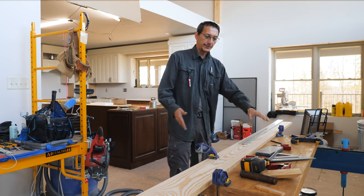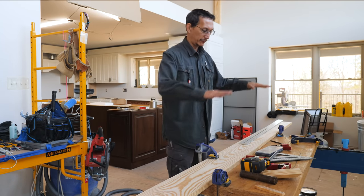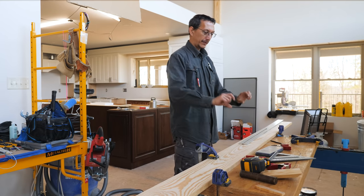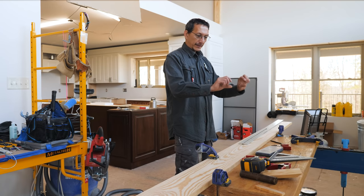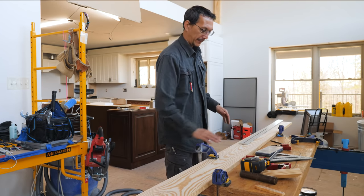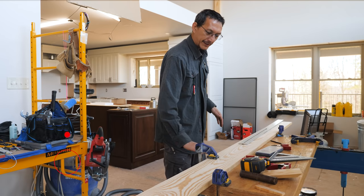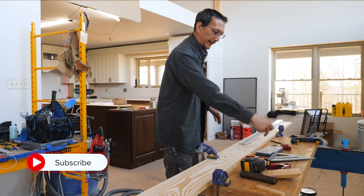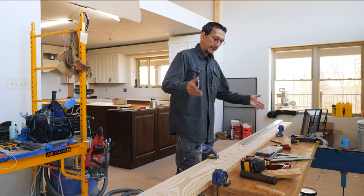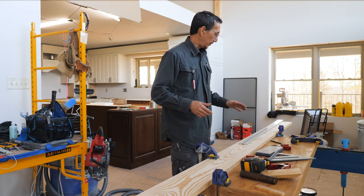This is the shoe rail board, and this is what goes on the ground, on the floor, and then you drill your holes for the pickets. You can do a shoe rail that's off the ground, but I don't want to do that — I'm going right into the floor. So I have a place for my flooring to terminate, and I'll trim the other side against that wall with a piece of trim. First, I've got to lay out my holes here.